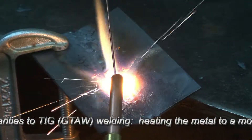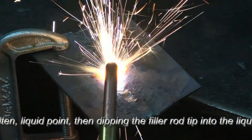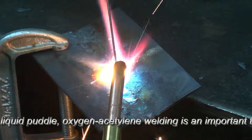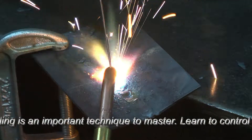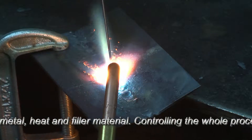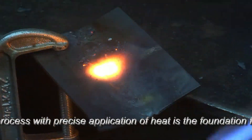Notice how this is more uniform this time. We have a nice crown to this bead. We're approaching the hole — not a problem. This is all molten metal. Take the opposite side down a little bit to reduce the size of the hole in the process. The idea is to make this one continuous piece of metal with proper thickness. If you fuse this properly, the filler metal is as strong as the actual plate. We're using ER70S2 — 70,000 tensile. It's really okay to fill that hole completely with filler, and as long as your fusion is there with the base plate metal, consider that a part of your weld and move right on from there. There's no problem with strength in that area. There you go — the hole is gone.